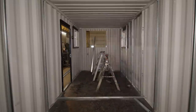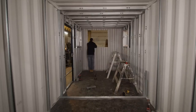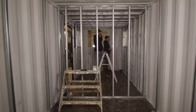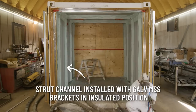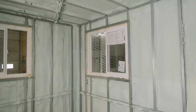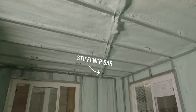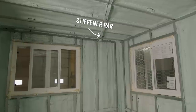Josh and William are steel studding the interior using two-and-a-half-inch steel studs. Next we're going to try using inch-and-five-eighths steel studs and actually pulling them an inch away from the corrugations. We've also plywood-lined the partition wall prior to spray foam so we're able to insulate that as well, to separate the heated portion of this container from the non-heated portion. Notice we are using metal furring strips to keep all the studs nice and straight while the foam happens, so as it cures and expands it doesn't twist or bow the studs.